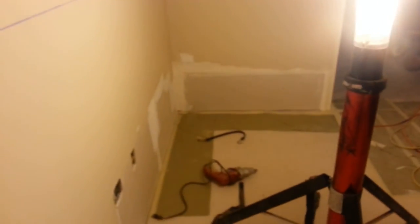Basically, when this is installed, you don't want to run into that inside corner. It'd be a pain. So I make them just right to where that goes just like that. You see that? That is perfection. Some people carry a little dummy piece in their bag, a little 2 to 3 inch piece of this chair rail. It's not a bad idea. I don't. I know the measurement. It's 3/4 in my head. So make sure everything's level and bang it out.